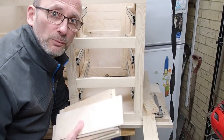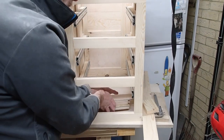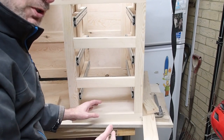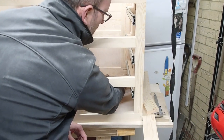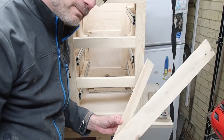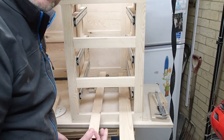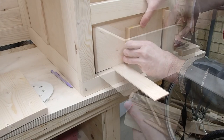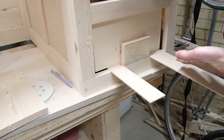So it's not the best or most beautiful thing that I've ever done, but a select stack of wood in here, where it mates up with the top of this nice and flush, is the best thing that I've found so far. What we do is we move it to the back about 3/4 of the way down, and I have two strips here that are about 1/8 inch depth, or 3 mil. And what I'm going to do is just place them right there and right there and use them as rails. And then we just slide, or draw, it all the way back and push it until it's flush with the front. And then push down to make sure that the drawer is nice and flat on the skids.